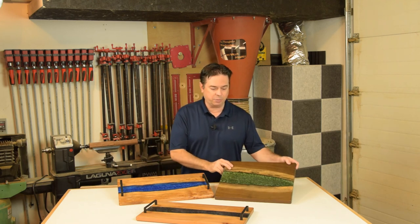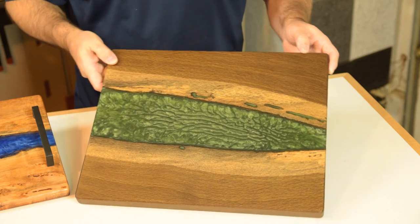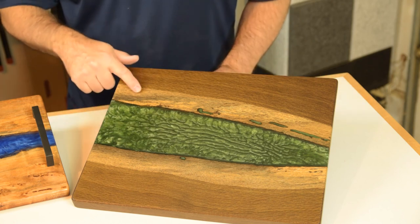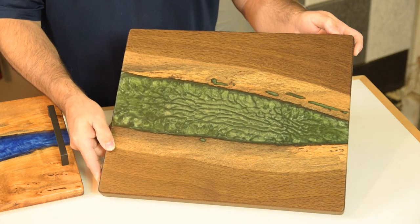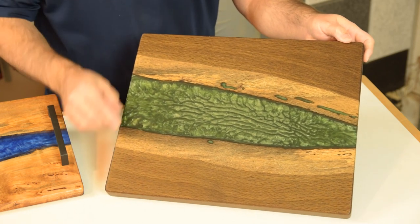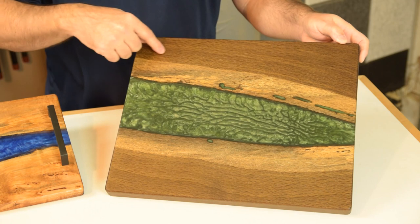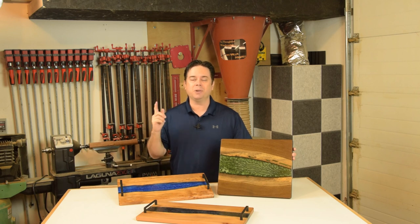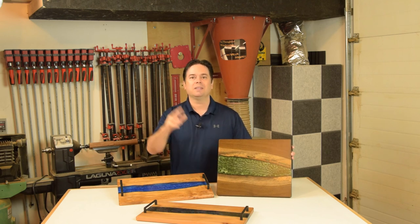This board we did a little bit different — we used white oak and decided to fume the project. We used 28% ammonium hydroxide in a rolling beach cooler, which forms an airtight chamber. About 12 to 14 hours in the chamber can give you this nice decorative effect. There are some safety precautions working with ammonia you'll have to research on your own. The net effect is a lighter color on the sapwood of the white oak and a deep nut brown on the heartwood — a fun look if it's something you want to experiment with. Hopefully you get a chance to try some of these river epoxy boards yourself. Thanks for watching, we'll catch you on the next one.